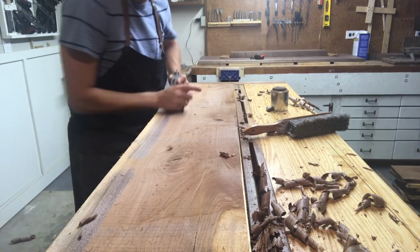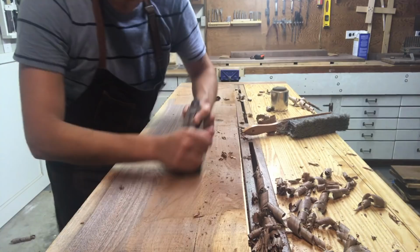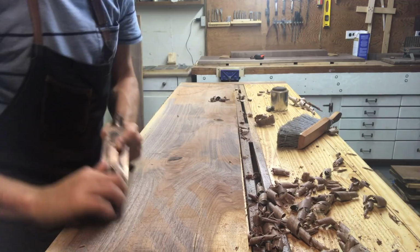I can't say exactly how long it took me, but this one clip, which I'm not really going to cut until I get very close to the end, gives you a really good idea of just how long it takes me to surface plane it real quick just to reveal the grain. This clip itself is about 50 seconds long, so I'd say each side, if it works really well and goes quick, 1 to 2 minutes per side, just like I said, to see what the grain's like using a scrub plane.